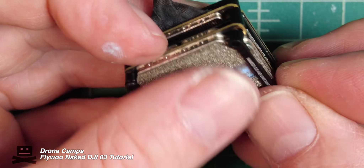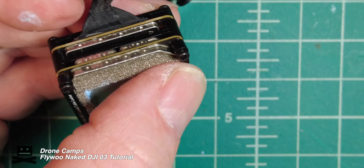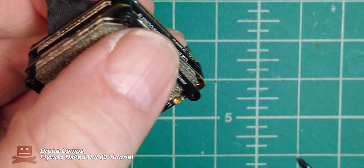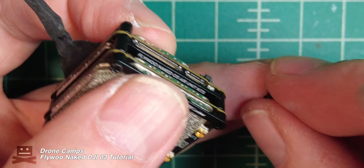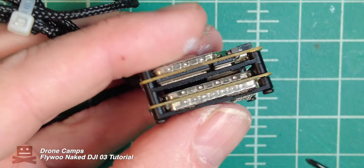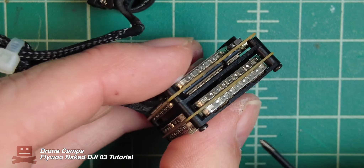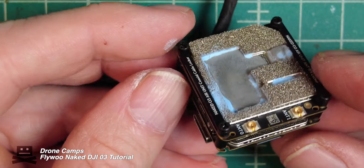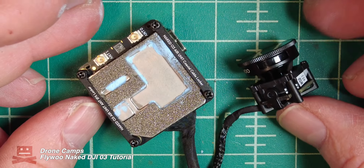You'll also have one on the other side. Don't forget to put your dipole antennas back on before you fire this thing up for the first time. Go down through here on this side as well. Gently bring the screws to a firm position. Now you have decased your O3 and you're ready to put your antennas on.